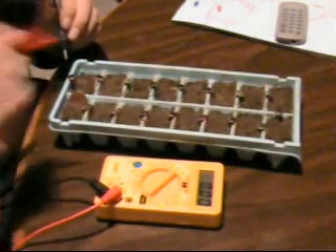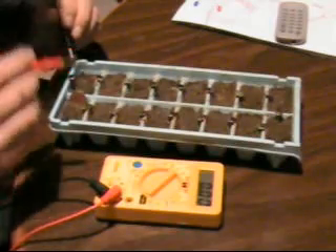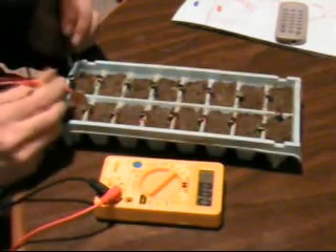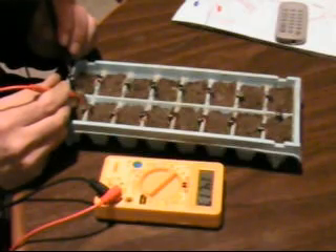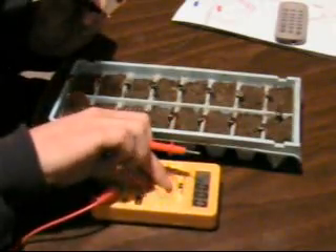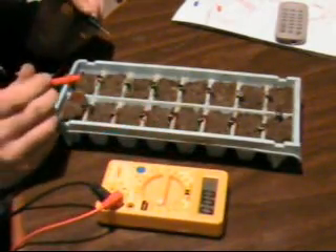Salt water, followed on top by equal parts spirit of salt and vinegar — watered down of course, both of those, before they're mixed. And that's nothing surprising to me. I expected to get about 12 volts out of that, I'm getting 14. But what I was really interested in was raising the amperage, and that's done through adding the spirit of salt and the vinegar, it seems.